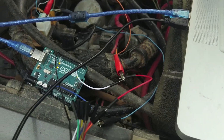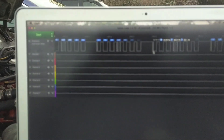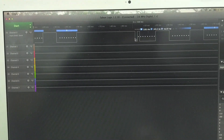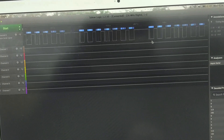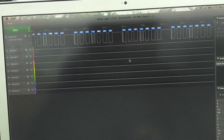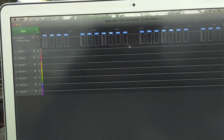We've got the Uno and our logic analyzer hooked up. Using the internal pull-up, I finally get to check this out — and look, these signals are beautifully clean. There are no glitches like I was having before. They are solid. The program picks it up perfectly and just does awesome. You can see each little bit. This thing is doing great.